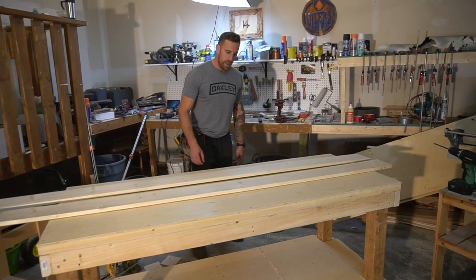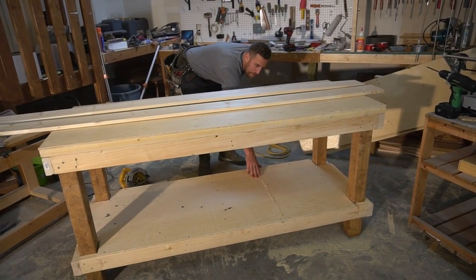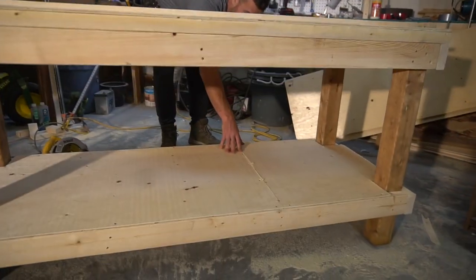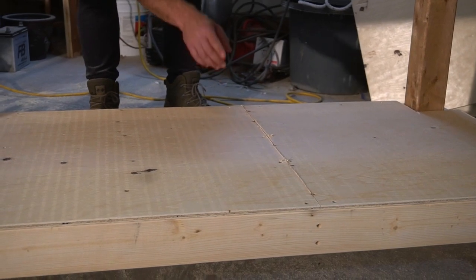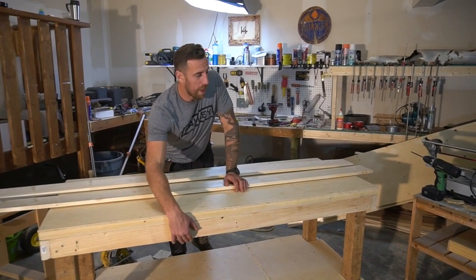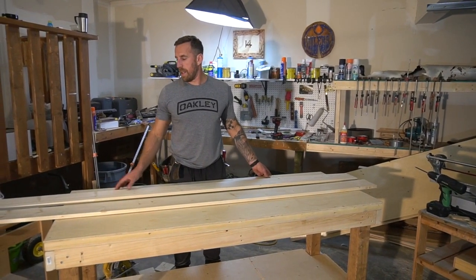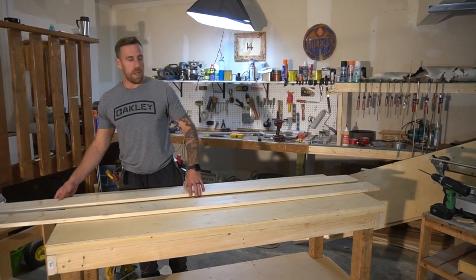We got our top plywood and bottom plywood in, but we ran into a bit of an issue — a puzzle we couldn't solve. So we had to cut the plywood on one of our joists: we came in two feet, cut it, then screwed it down. We also decided to put on one more collar to hide the layered wood — we'll cut those at six feet for the long sides and twenty-seven and a half for the ends.